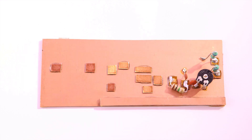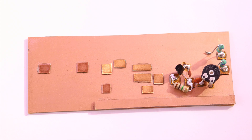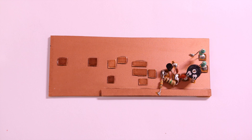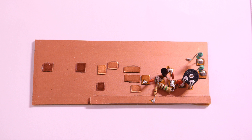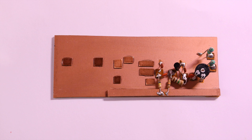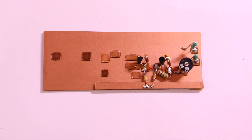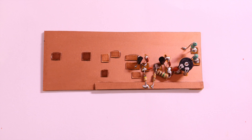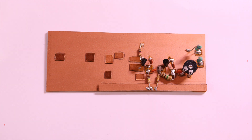From this pad to the other I placed a 1M ohm resistor and a BC547 transistor, with the collector to one side of the resistor, the base to the other side with the two capacitors, and the emitter to ground. From the pad with the collector I soldered a 10k ohm resistor to plus, and from there to the next pad a 100nF capacitor. Then from there to ground a 1nF capacitor, and from this pad a 100k ohm resistor. After that I soldered another BC547 with the base to the pad with the two capacitors and the resistor, the collector to the larger pad, and the emitter to the other larger pad. Then from the emitter to ground a 1k ohm resistor.